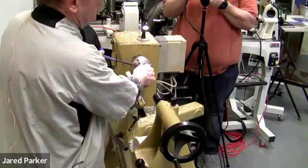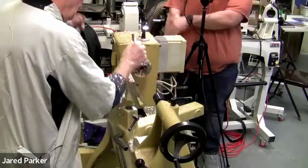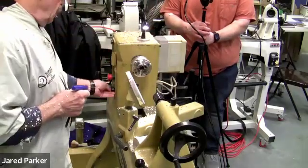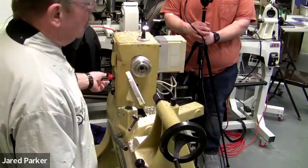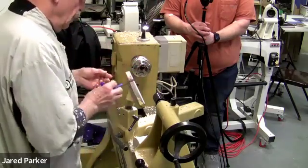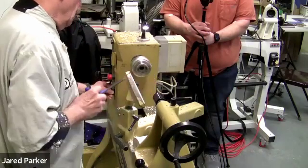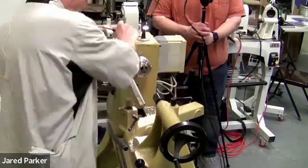A lot of people shut their lathes off. I think Philip Duffy was in here still? He already left. He was one of the gentlemen whereby I never shut mine off. Leave it on. All of a sudden you go, oh, okay, I'll shut it off. Next thing you turn that rascal on, you don't realize the speed is going full tilt. Finger gets caught in there, whatever. He broke a tool rest. That happened to him. He stuck it in there and snapped that thing right off. But I always turn the dial indicator, the rheostat, down to 0. I know exactly that thing is down there.